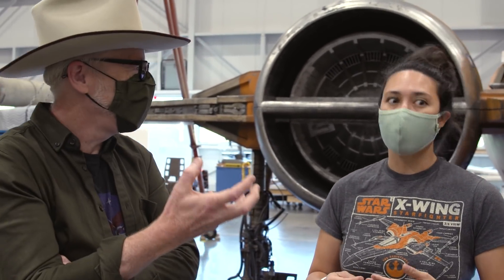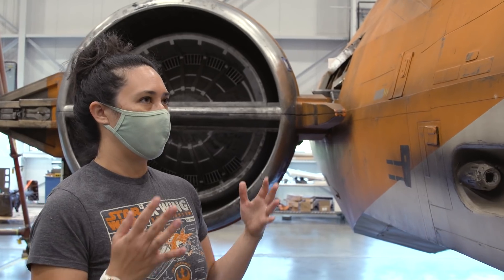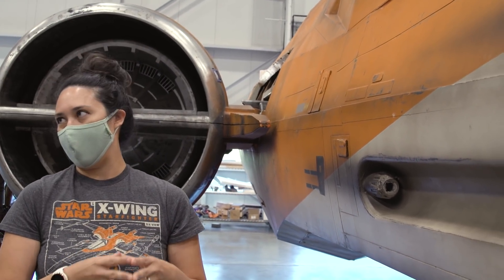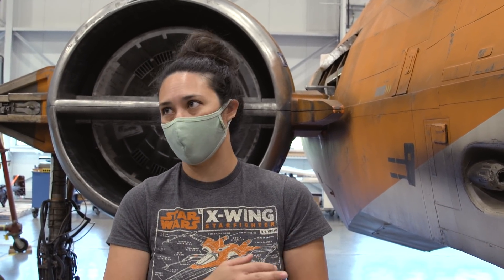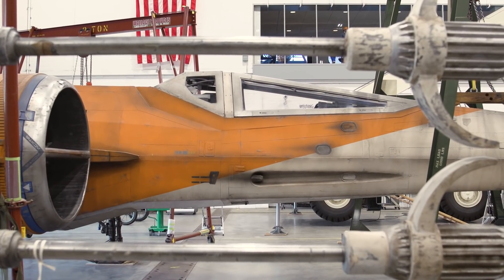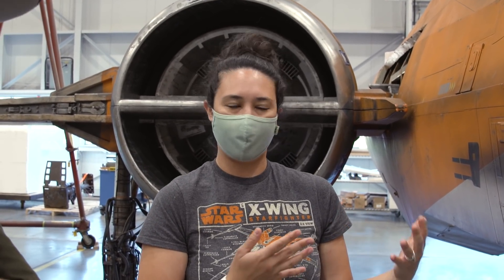Can you talk to me about some of the difficult decision making? Sure. A lot of it has to do with how the materials are going to interact. Though it looks like a nice solid painted piece, that's not how it was made — it's multiple materials. You have some inherently flexible materials and some inherently inflexible materials: resins, paint, primers. When anything moves, you get vibration, and the flexible materials are fine with that, but the inflexible ones are not — and they cool at different rates. Eventually they just crack in various ways.